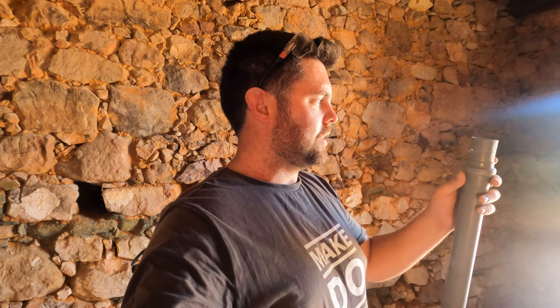Yeah. So the short version of this story is these pipes are designed to have the rubber seals with them rather than PVC cement. We thought that our friendly Portuguese plumber friend was saying cement is better. In retrospect, what I think he was saying is use the seal and cement. That's better. So it's like doubly safe. But actually the seal is perfectly suitable for this. We don't need the addition of the cement.